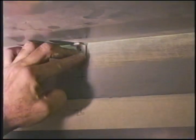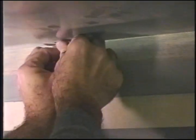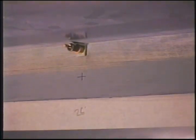Now I'm going to put it in here without pushing on it. Take one of the clecos here, put it to the side of the skin. Ran into something there, something substantial. Piece of epoxy. Now if I'm careful, I don't pull this cleco through as I'm tightening it up. It's conceivable that that would certainly handle the little bit of weight that it's going to see shared amongst all three of these little clips. I'm going to put the other two in and I'll be back with you in just a moment.